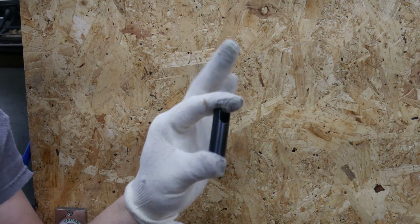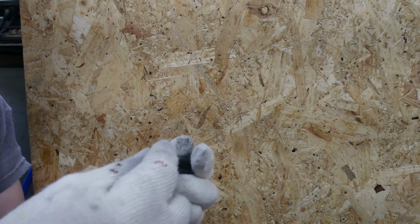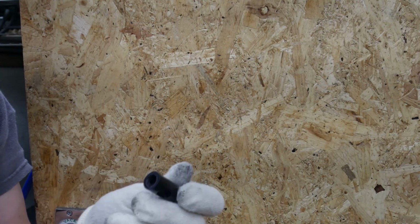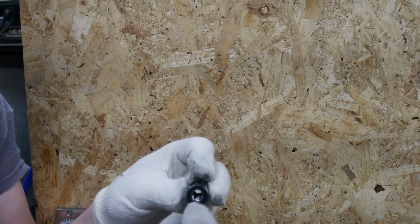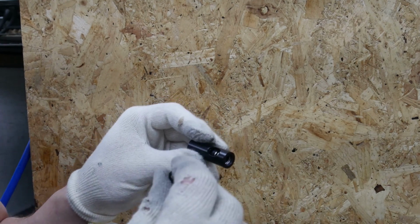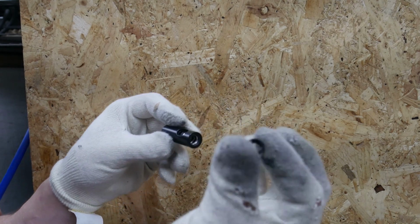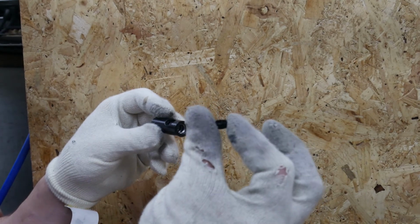So with our hinges we developed our own ball joint system. Normally most manufacturers use the same Chinese ball joint. If you look really closely at any fitting that you might have, you'll notice that the majority of the ball joints are very similar, and that's because there's a couple of Chinese manufacturers that basically make them. So we machine and anodise a little washer that we make on our machine, and a little threaded section that we also make on a machine. This actually has an external thread and an internal thread.